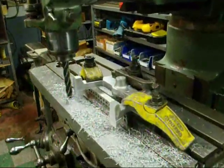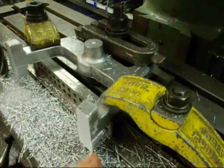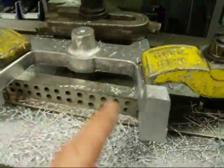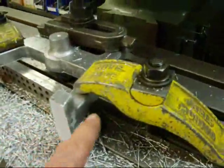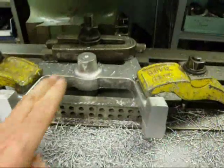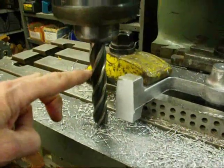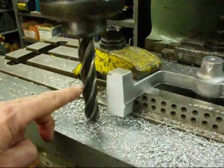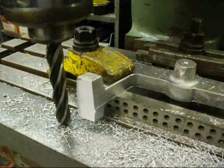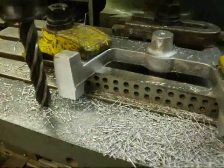I'm in the process of milling the feet off on the pedestal of the steam engine. Notice the setup I've got on the Bridgeport — the feet are hanging over the table, clamped on some inch-and-a-half parallels. My clamps are pretty much right over the parallels, so there's no flexing. I've squared it up with the table. I had to use a real long end mill — this ended up being a 4-inch end mill, much longer than I wanted, but I didn't have a 3-inch. There's a little bit of chatter and it's hanging out too far, but that's the best I could do without buying a special tool. It mills far better with climb milling than with conventional milling.